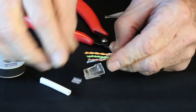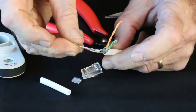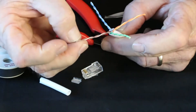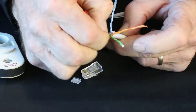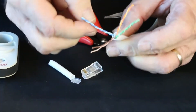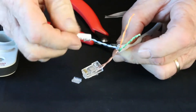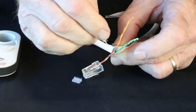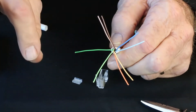I'm not throwing my jacket away — remember we always use that to separate our pairs. We're going to pull these out south, north, east, west, and open each end. Take the jacket, go down, and separate each one. Now we're separated, got our kinks combed out, and I'm ready to lay out.